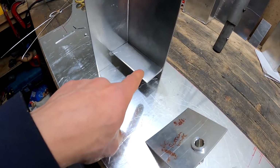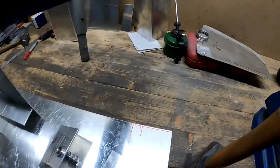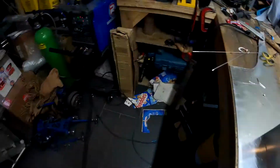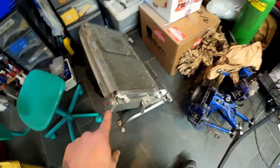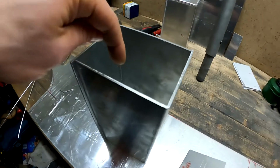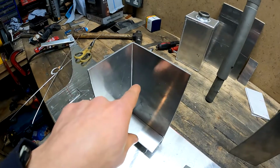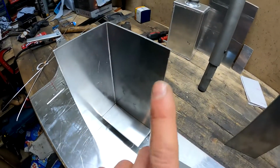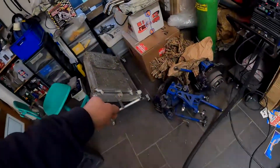So this is a baffle, or a partially baffled header tank. So this is something that we use at work. So the idea of this header tank is, this will be the vent that comes from this part of the supercharger radiator. So this is where all the air and bubbles should come out, and then will be put in above the water line in this 3-litre header tank. The idea is that the bubbles will come in, fire into the top here, and then there will be some time, and this will give the final protection just to make sure bubbles don't come straight out and go straight down into the makeup line and then back into the system.